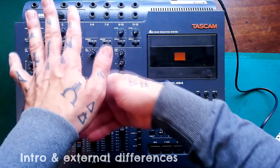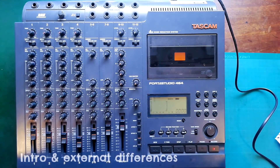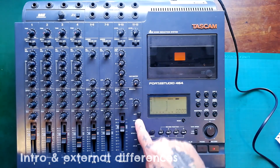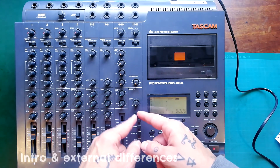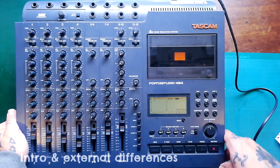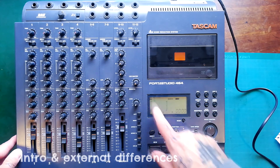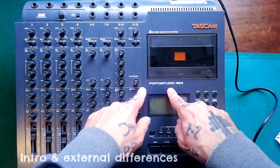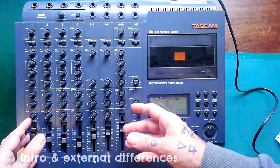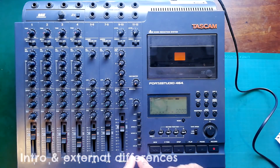I'm using mailing bags — you could use anything non-conductive — to stop the upper and lower printed circuit boards shorting against each other. I do some signal tracing and end up finding that it's the master fader that was broken, so I replace that. After that there's still a problem where the bus switches are behaving strangely, and I end up doing quite a lot of track repair, replacing capacitors and resistors around that area of the board. I also go into how this differs from the pale grey one on the circuit board.